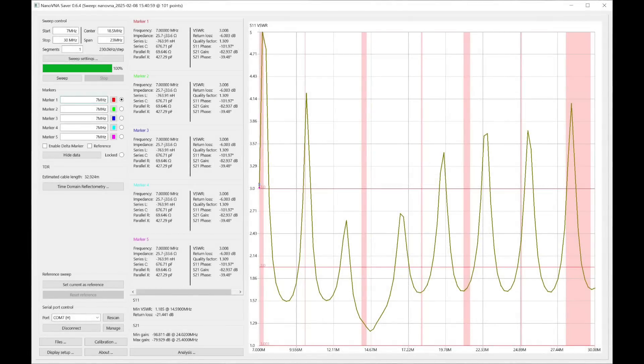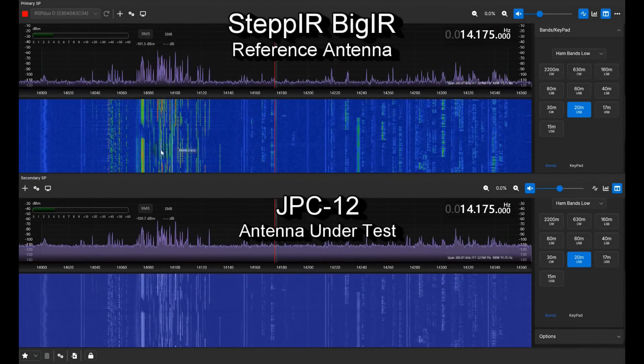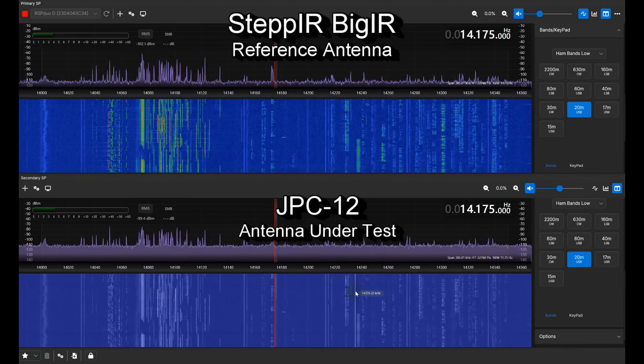Tegan went out and reset the coil for 20 meters. There are two spots marked — one is supposed to be for 40, the other for 20, and then after that you adjust the length of the rod. As it turned out, we got a nice SWR showing a very low SWR right in the 20-meter band. Note that all the other nulls are below 2:1, but in terms of ham bands, we've got a low on 17 and pretty close to a low on 15. This is tuned for 20 meters. This is the reference antenna — a unity gain vertical antenna — and here is the antenna under test. It seems to be doing pretty well on 20 meters.